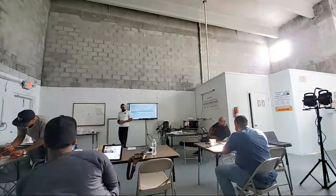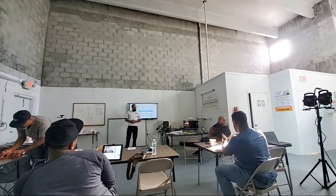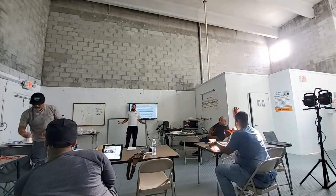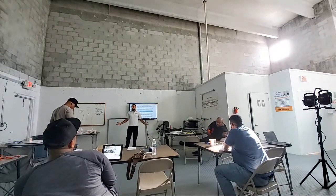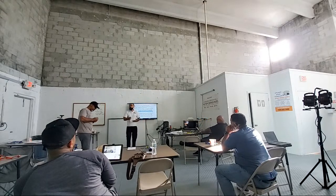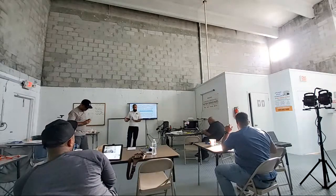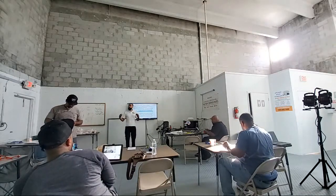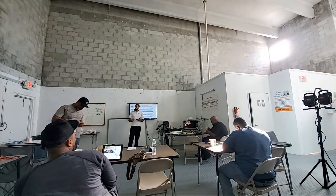Gentlemen, I want y'all to take pride in this. I want y'all to take pride in what y'all are doing. Oftentimes, people get to a refrigerator, they look at the compressor, and they don't even know what to do. They'll put their hand on it, that's the test. I'm showing you how to not only test the compressor, but let's test the protection devices that protect the compressor. Remember, it's in series with the compressor.